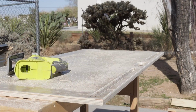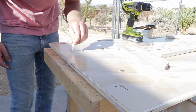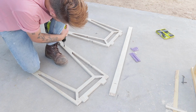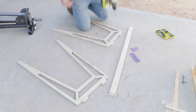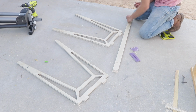So like you saw in the beginning of the video, the legs and the stretcher disassemble and attach to the bottom of the tabletop to be transported, and the way they attach is with magnets. I just drilled a hole on the bottom of the table for each of those magnets and corresponding holes on the legs and the stretcher so that when everything comes together, it snaps and holds in place really well. I use Gorilla Glue Gel, which has a really quick set time and doesn't run like traditional super glue. I'll leave that linked in the description.